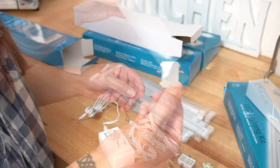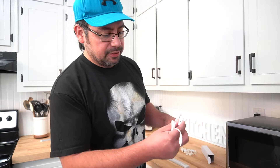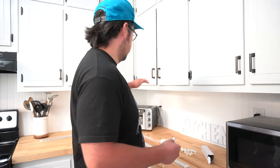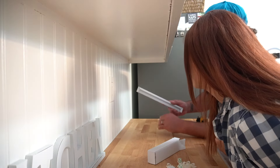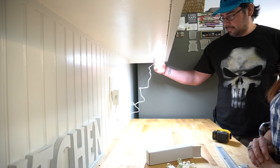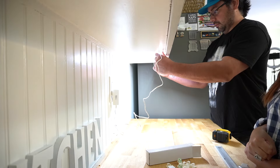These come with different pieces in your kit and each of them serves a different purpose, but the instructions are really easy to follow. One of the reasons we use these light fixtures is that they're very versatile — you can either butt them up against each other with the rigid coupling, or you can space them out with the flexible coupling. That all depends on how many lights you need to put across and how big your kitchen is. It's all preference — do you want a ton of light or just ambiance? Since these are dimmable, we went with more lights, but it's all up to you. Next it was trying to determine which way we wanted the light to face, because it has a little silver bar — you can either put the bar towards the back and it shines straight down, or you can put that silver bar to the front and it will actually shine on your backsplash.